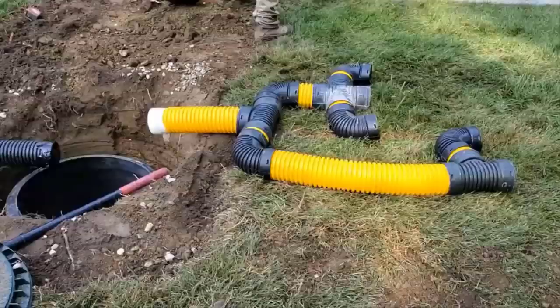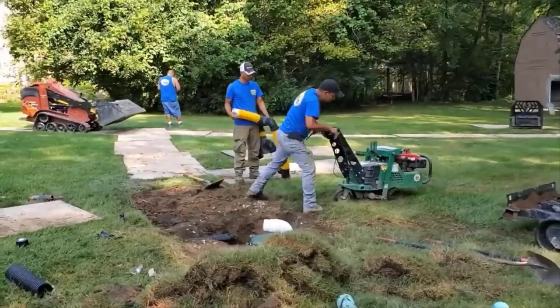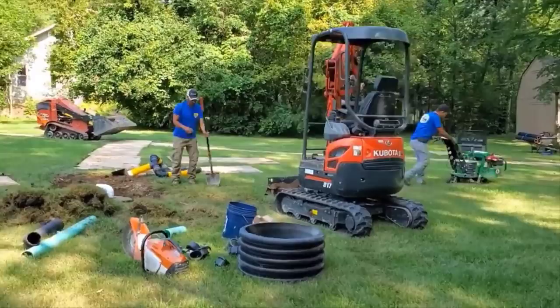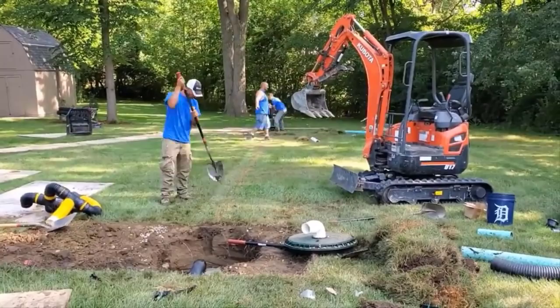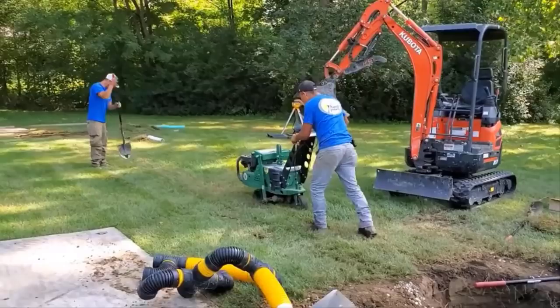because I just wanted to mention that you always want to drill your vertical drywell first, and I'll tell you why. If you start by cutting the sod off and just trenching out the leach field, and then you go for your vertical drop, the auger is going to keep... It's almost like it's thrown off balance when there's not the dirt 360 degrees all around it. So that's something that we've learned. You want to definitely do your vertical drop. Go ahead, do your auger first, and then go into your horizontals.